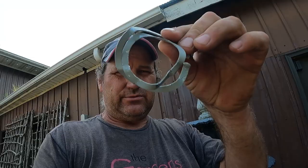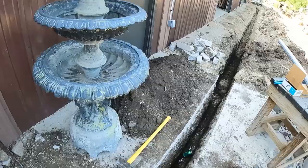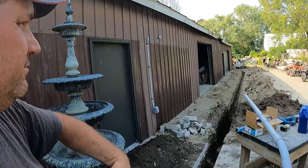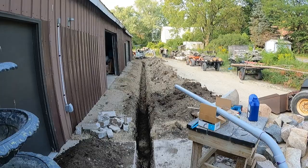Sometimes what happens when it's hot out and you're not the real electrician — you're just getting it all ready for your electrician — you take one too many rings out, which means the two-inch fitting I have is not going to work. So I have to get a two-and-a-half inch coupler and do a bushing to size it down. In under 24 hours there's going to be a wedding here and this has to be installed, cleaned up, and ready to go.